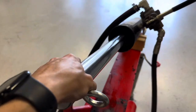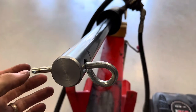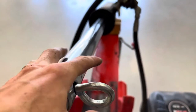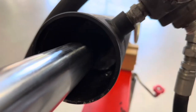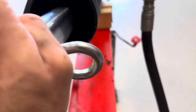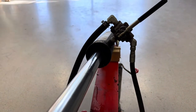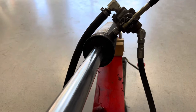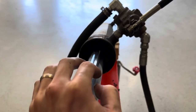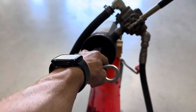It was hard at first. I stuck a little trailer pin through here just to help get a grip, and I'm pushing it in and you can hear and see that it's contracting and pushing all that hydraulic fluid back into the reservoir. You want to get that pressure out so it comes out easier — it's got a lot of suction. This thing is about 10 years old, so just keep working it loose.